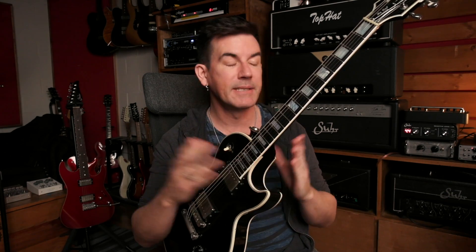You're still getting a full frequency range of the amplifier coming through at a really low level on the pot. The smaller value caps are going to shift the active frequency up higher. What I've actually discovered is that if the cap is lopping off mids but only letting treble frequencies through, that actually sounds harsher to me than the big cap that's letting through all the way down to kind of the upper mid-range. I did like the 100 picofarad cap as well, which is just letting through the upper end presence frequencies and that seems to work pretty well all the way across the range of the volume one pot.